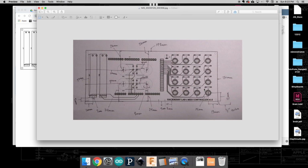With this, since the push buttons are actually square, and the push buttons themselves are 10 millimeters by 10 millimeters, I'm going to be making 11 millimeter openings. Again, just a little bit of tolerance on each side to let that button push through and move easily.